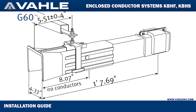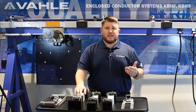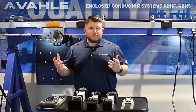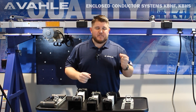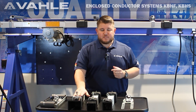Our funnels are meant to handle bigger air gaps — for example, areas where we have customers that are galvanizing with automated galvanizing systems that go in loops and come back around with switches and everything like that. In those galvanizing facilities it can be outdoor temperatures basically, and you can have a huge delta change. You're going to see those beams move back and forth, and that tolerance is not easily maintained with that big delta change. So what we would recommend in those big delta change areas where you can't maintain that gap is to use this funnel. Also, whenever a collector leaves the system completely and is just going to be free hanging, that's when you would use the funnels with our flexible tow arm.